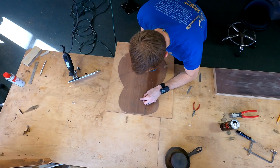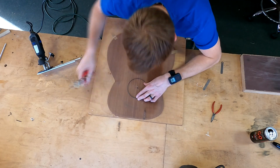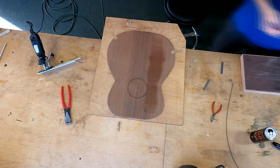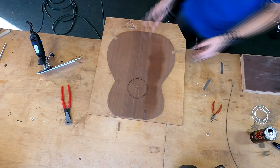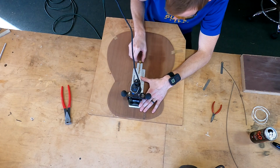Once I've routed my channel down to depth, I start creeping up on my final width of the channel by test fitting the elements of the rosette until they just fit. With every pass of the Dremel, I adjust the radius just a hair wider to sneak up on that final fit.